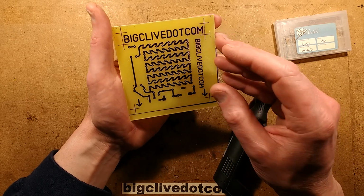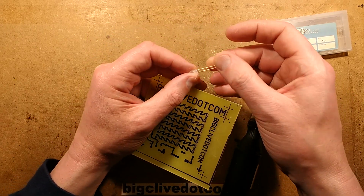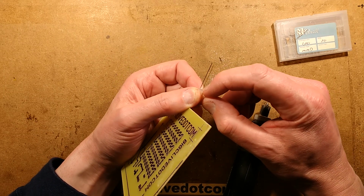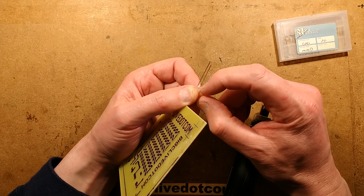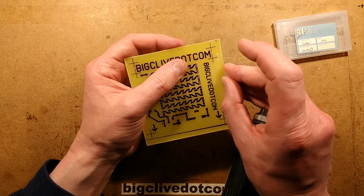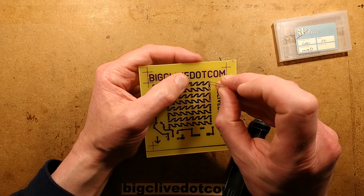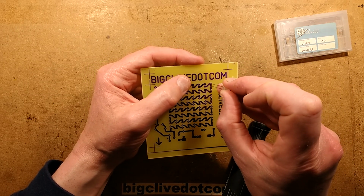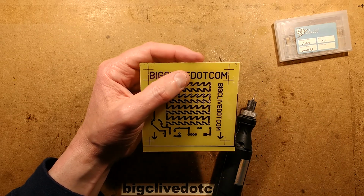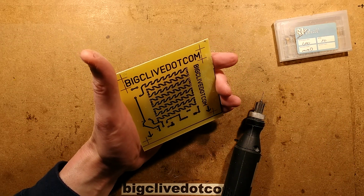And it is just because if you look at the back of the LED, if you drill the holes too small, there is just that little sort of wick that comes up from the resin onto the lead. And sometimes it means when the LED sits down, it can wobble. It doesn't sit down absolutely flush to the board. When you drill the 1mm holes, it sits down solidly onto the board and just locks straight on for soldering. So that's the best option. So I'm going to drill this and I'll be back in a moment.